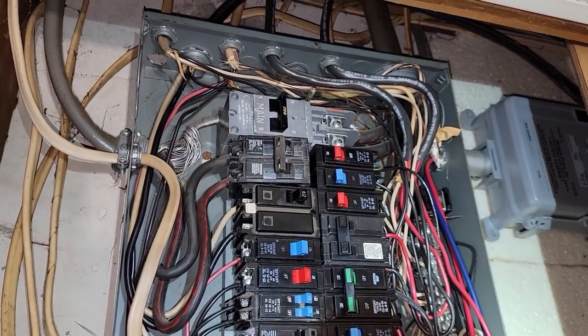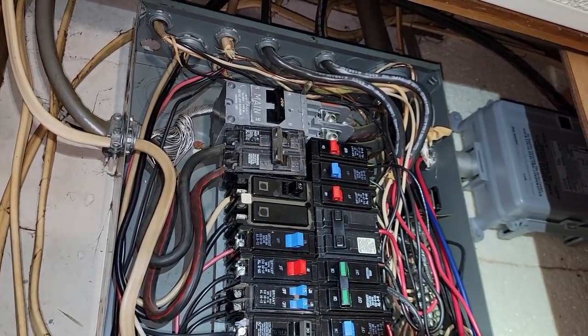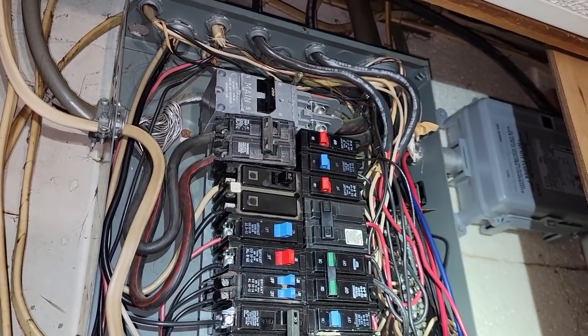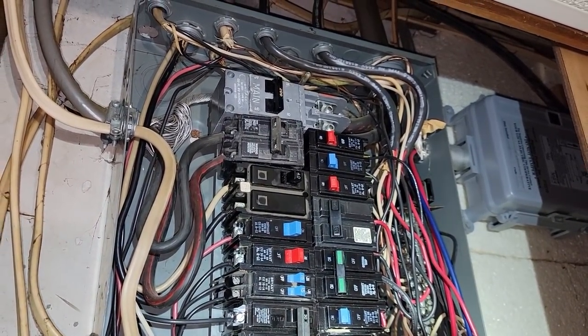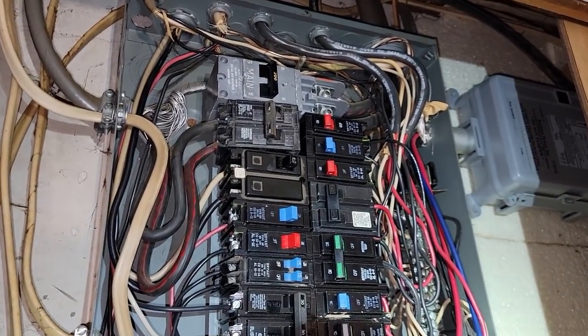You can't pull 20 amps per element - say 22 amps times 3 is 66 amps, plus the blower another five or six amps, that's 70 amps. You need to be 20 percent underneath your breaker - it should be about a 100-amp breaker. Supposedly 2-AWG aluminum - I'll have to double check the charts, somebody's telling me that's good for 100. I need a 100-amp breaker.